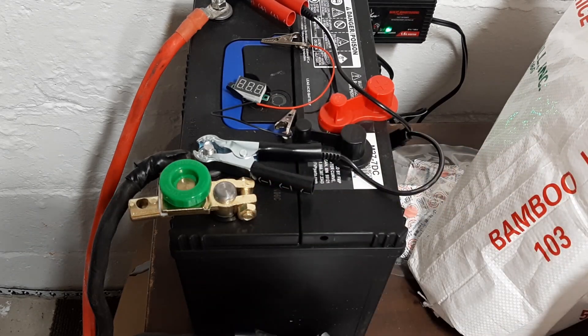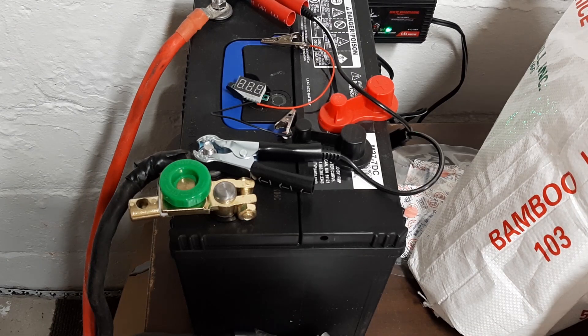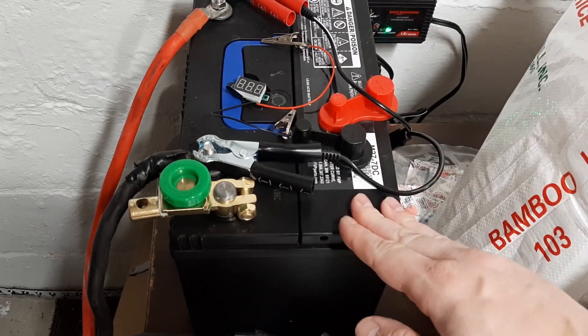I have an identical battery on my solar rig upstairs. I only have a 10 watt solar panel right now and it's winter - that battery is actually losing power daily because it's all iced over, cloudy, and the earth is tilted away from the sun. But if I had a 50 watt panel and it was summer, would that be enough? The compressor turns on and off, and on average over the entire month it draws 19.8 watts continuously.